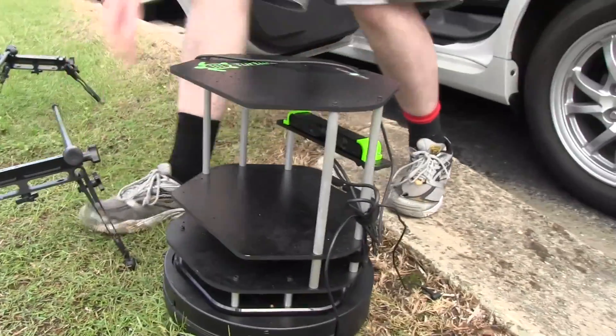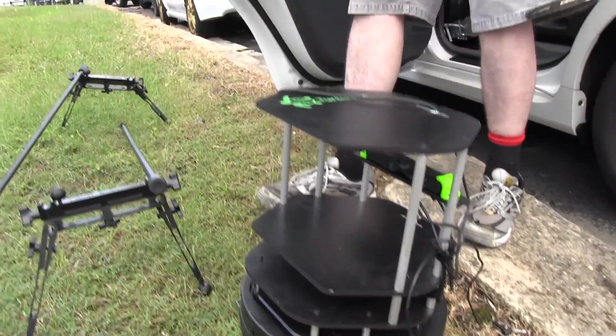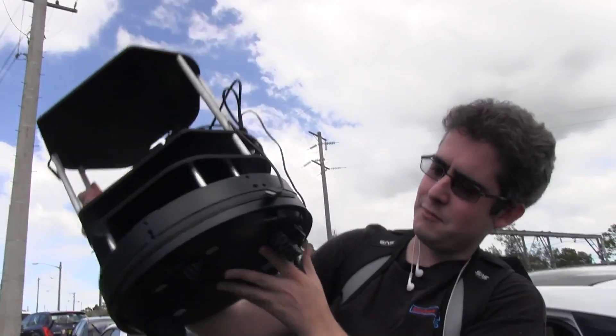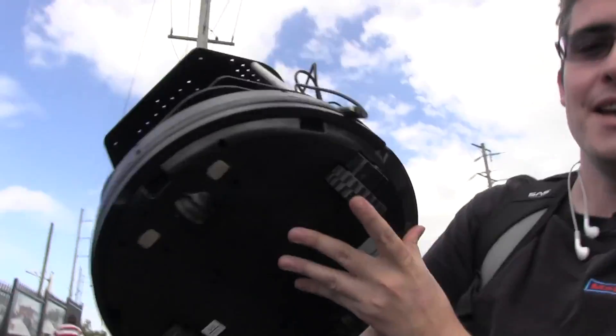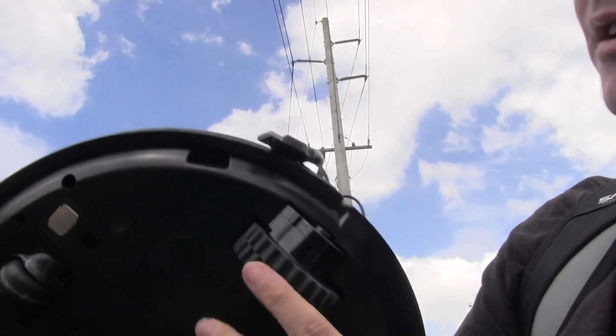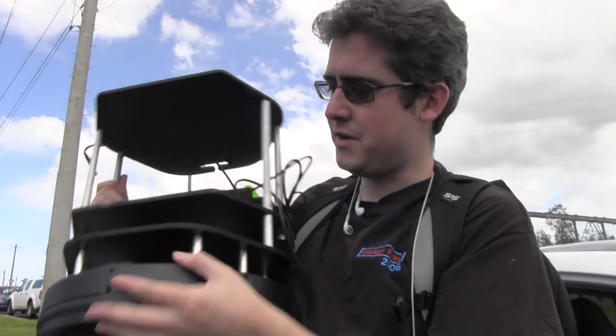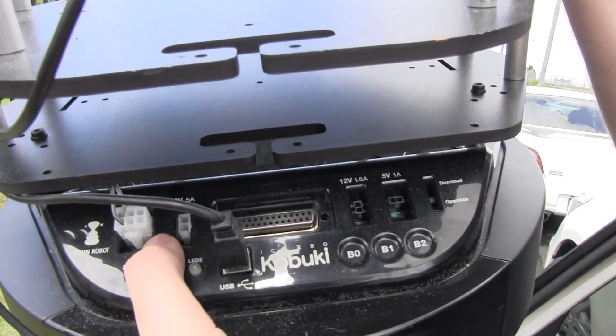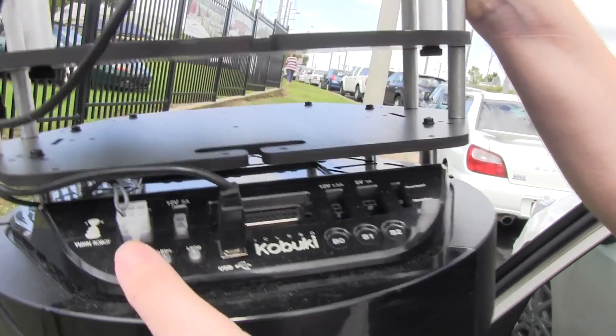I don't think they've officially finished this yet — I pre-ordered on the hardware and I'm still waiting on the software. But it's a fantastic robot base. There's encoders in the wheels there, so you can very accurately estimate how far the robot goes. It'll dock to charge, which the previous one didn't, which is very tricky. It's got a boost converter so I can power my netbook straight off the same battery — that solves everything.